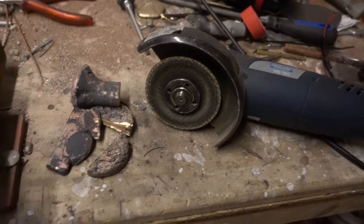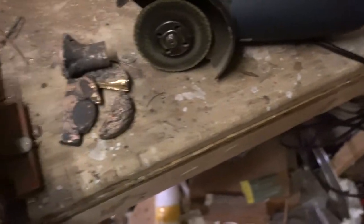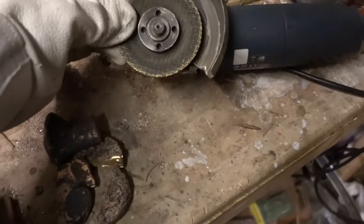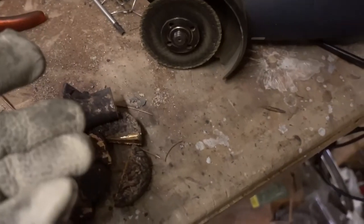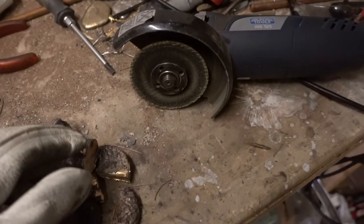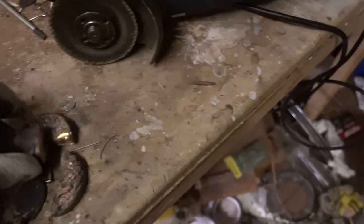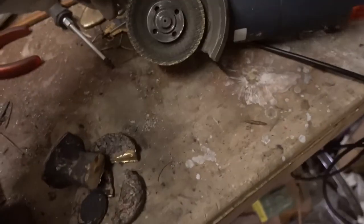A small thing that I want to show you. Look at that. It was a fresh blade, or a fresh disc. And I only cut one of the axe head castings, and look how it just wore away. I mean, I don't have anything else. I think there are probably special discs for tough bronze stuff and beryllium copper and things like that. I mean, if you want to grind beryllium copper, I think you need quite good protective gear. So just wanted to show you that.